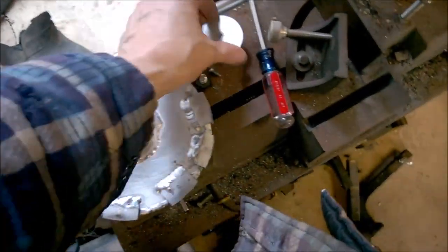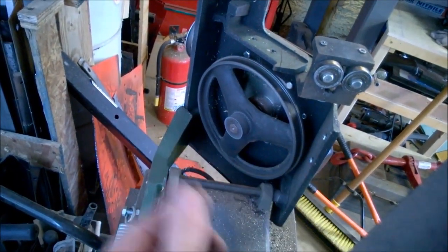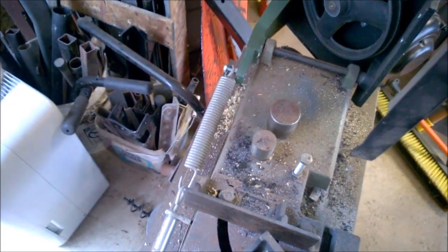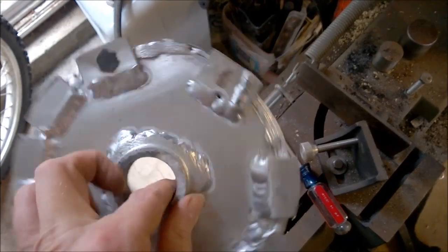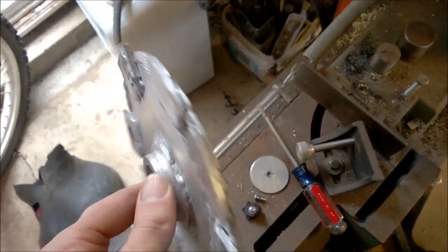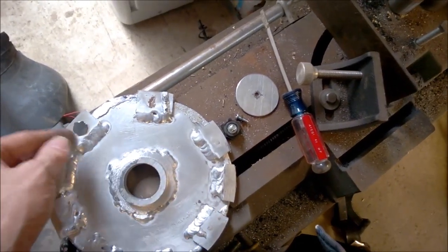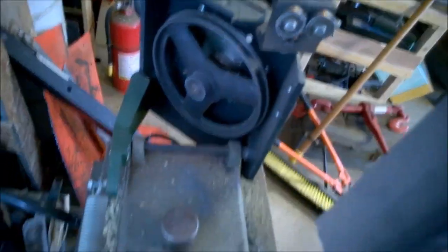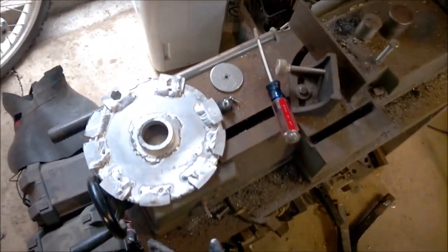I can't remember if I ever showed you guys this. For the bandsaw, that lower blade has a tendency to slip off sometimes because it's such a small diameter and it doesn't really have an awesome bevel on it. So I ended up making this out of a piece of sheet metal. Horrible implementation, but it works. Basically, I just welded a stud to the plate, and then placed tabs on it to catch the back of the blade. Then I tapped the center hole and put a little hub plate on and a screw with a lock washer, and that solved the problem dead.